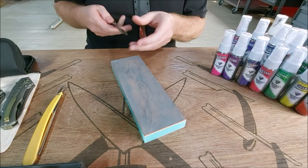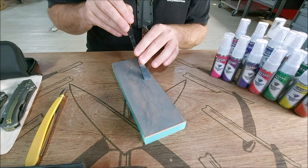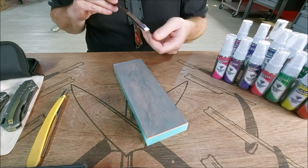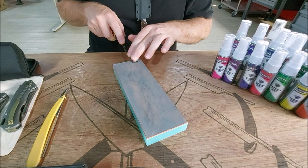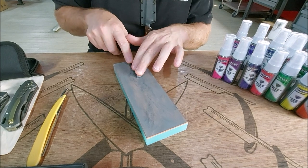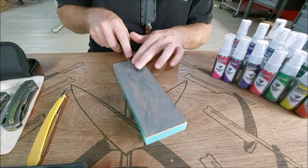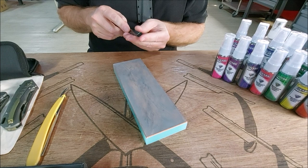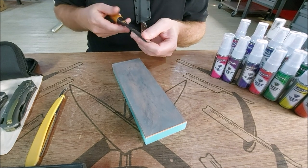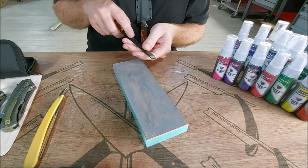On the flat side, I'm just going to wipe that down — that removes a lot of the burr. Find the angle and then you're just going to pull back. How much pressure you want to put is up to you based on compressibility, how much refinement you have, and how many strokes you plan on doing — the formula. I actually put a lot of pressure on a flat grind like this, or even a hollow ground on a plane. I tend to use more pressure on the flat because I want to really get rid of any minimal burr and force everything forward. Then I'm lighter on my bevel side, just tickling that to get a nice edge so it's flat and facing forward.